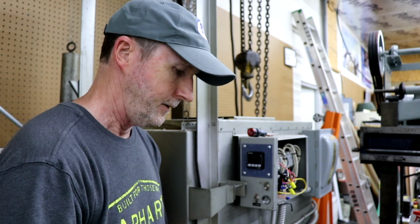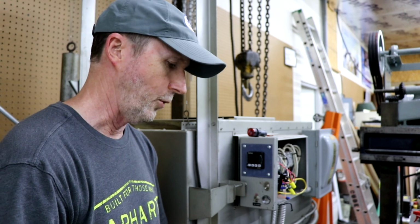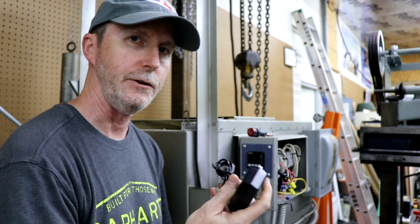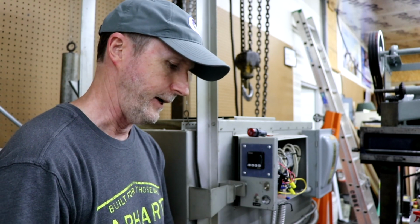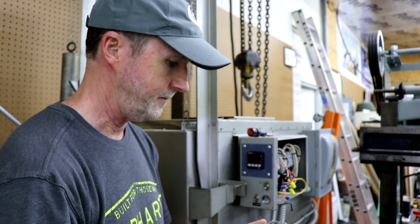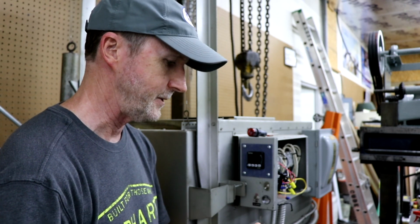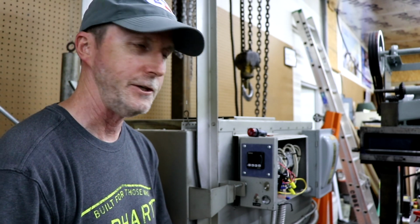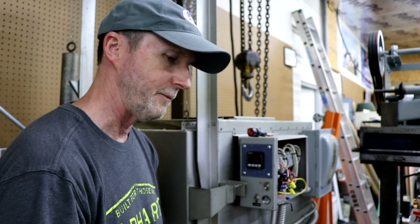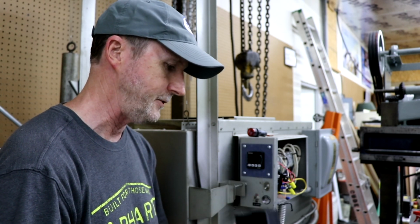The thing about the Arduino, you can either run it off the serial adapter from your computer, or you can run it off a battery pack going into the pins on the board, or you can use an AC/DC wall wart adapter. And that's what I'm choosing to do. After I've got this finalized, I won't actually have this breadboard inside the box. I'll shrink this down to very minimal wiring within this case, and it'll go inside the control box here. I need a way to plug up the power here, but I don't want to just cut off this cord here. I may want to use this in the future if I upgrade this or something.